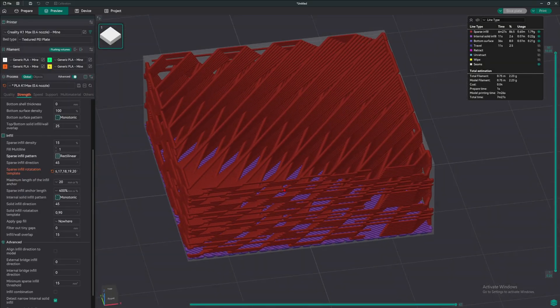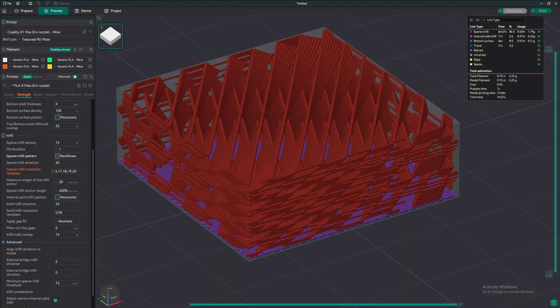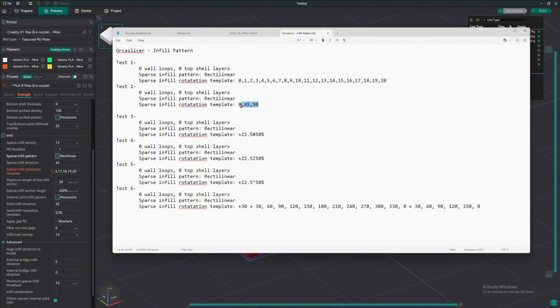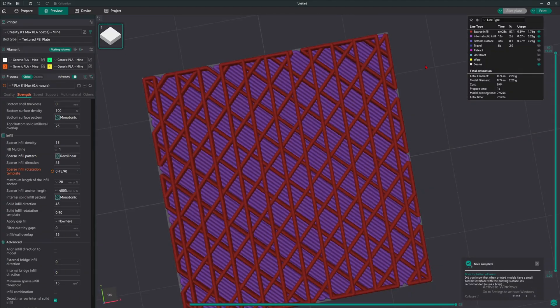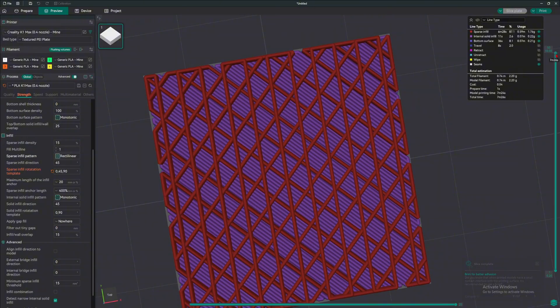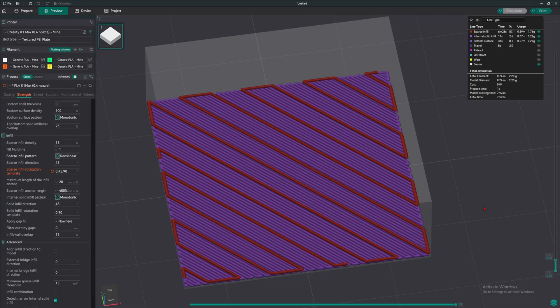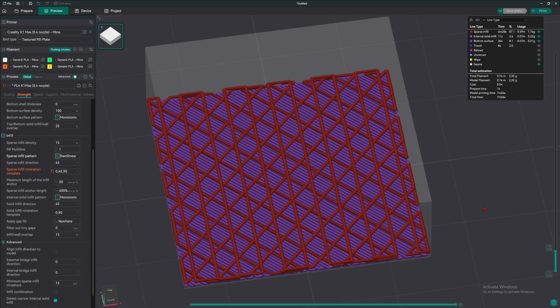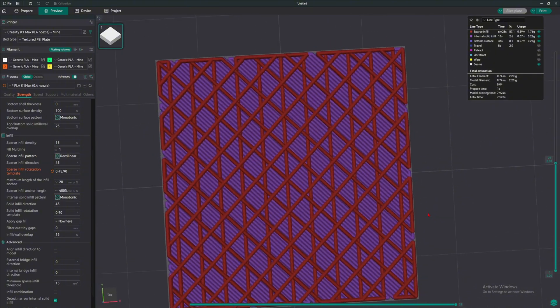Without the wall loop, I feel it's not going to hold. But this one just looks really cool. If you have time, you can do zero to 360, which would be really cool. The next one is the default from Orca Slicer — let's give that a try. Slice the plate and look at that: it rotates zero degrees, then 45, then 90. It repeats that pattern over and over, and the end result is a square triangle pattern, which makes this really strong.